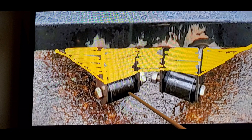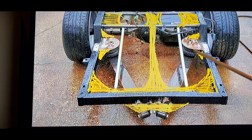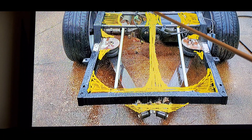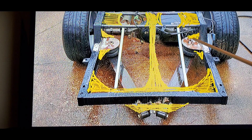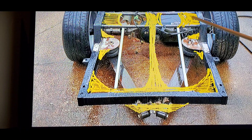Let's go to the next picture — this is an exploded view of kind of what I'm thinking. I was already going to put gussets on these, that was a given. The gussets are going down on this side and up on the other side. Why? Because you can't go down on the other side from here because of the way the c-notch is. So the gusset is gonna go up on that one, down on this one. This is a rough idea — I know I wanted to box this in, or at least put a plate here and a plate over here.